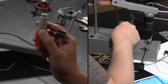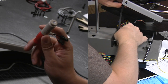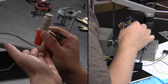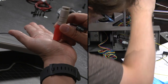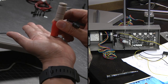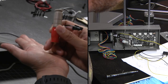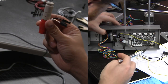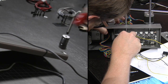And that's why, when you see those Tumblr blogs like the MakerBot fails or 3D printer fails, a lot of that is because the extruder isn't calibrated for the build platform, so it's not sticking. When the melted plastic gets pushed out and slides along the build platform, it doesn't stick, so it lifts up, and once it lifts up in the beginning, everything turns into one giant mess. Hopefully this extruder will solve for that.